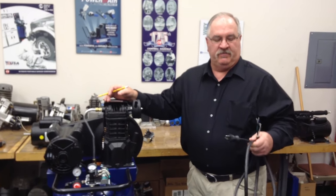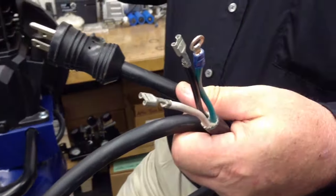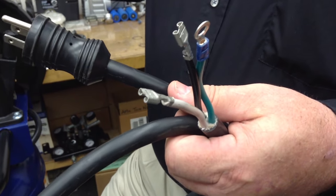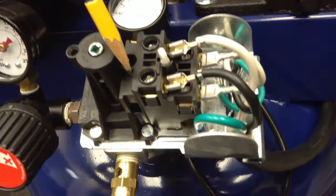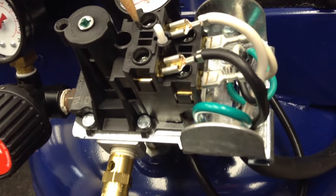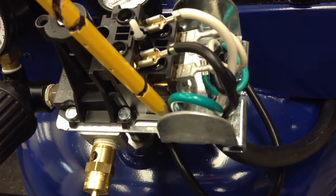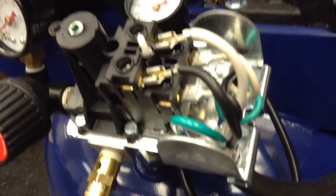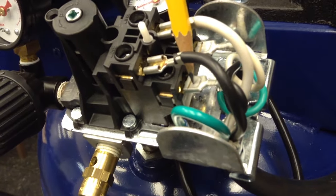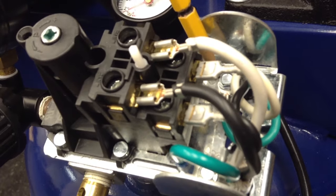When wiring most pressure switches, you're going to have your power cord or line coming in with three wires: a black, a white, and a green. They get connected to the pressure switch in the indicated areas marked line — black, white, and green to ground on the base plate. Correspondingly, you have the wires coming from the motor to the switch: black to black, white to white, and green to the ground screw on the plate.